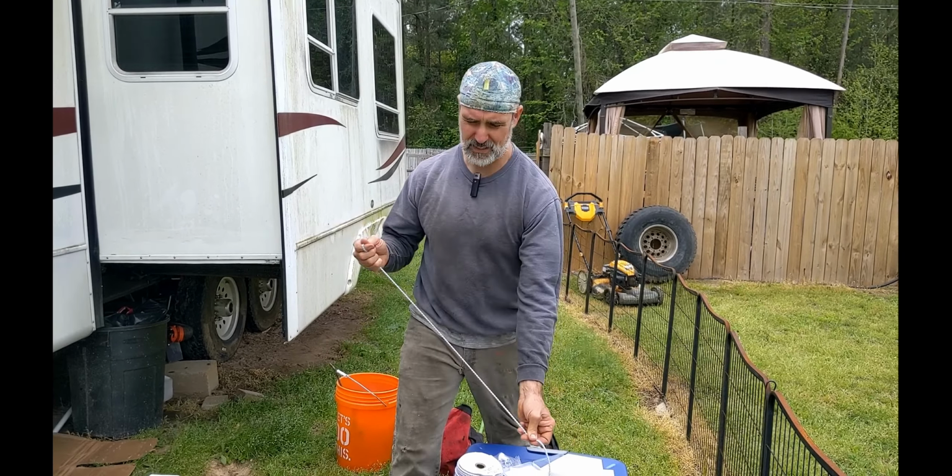Okay, so the next thing that we're doing is marking to drill holes for the shock cord. This is about 5 1/8, so we're going to mark 2 9/16 right there. And again, I'm just using the width of the tape as my dimension from the edge, because it's not that critical except that we want it uniform. So it's just an easy cheat to get a uniform result.